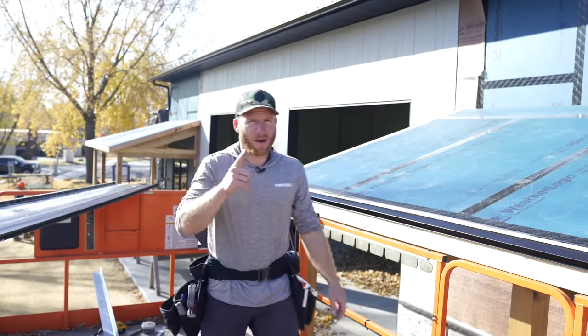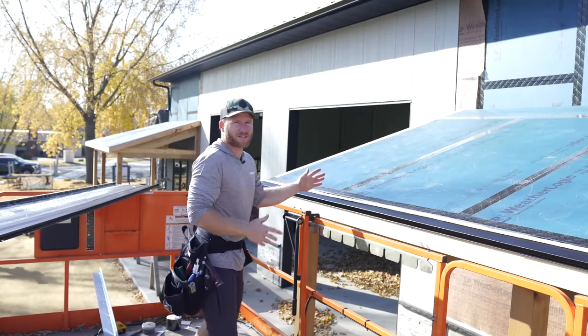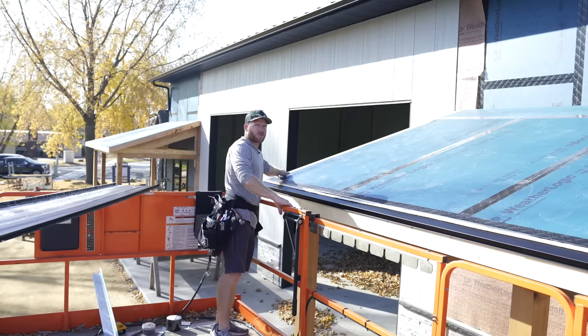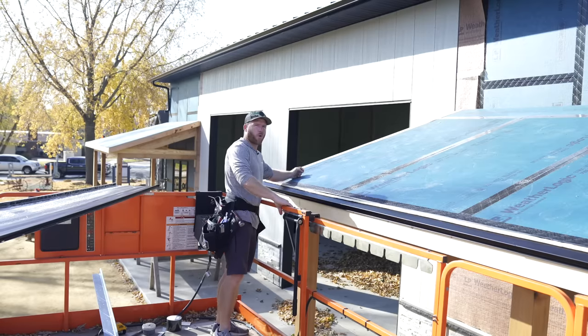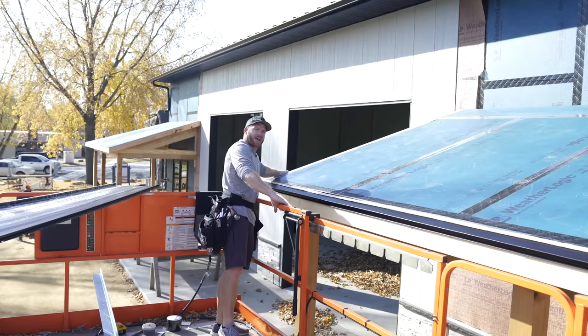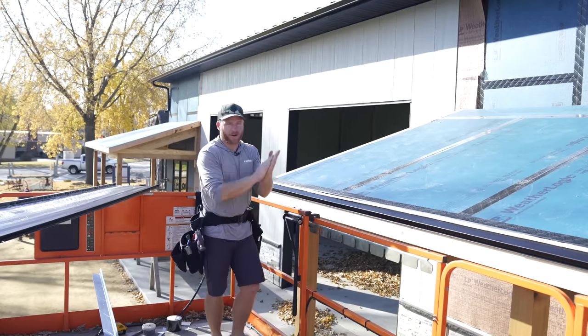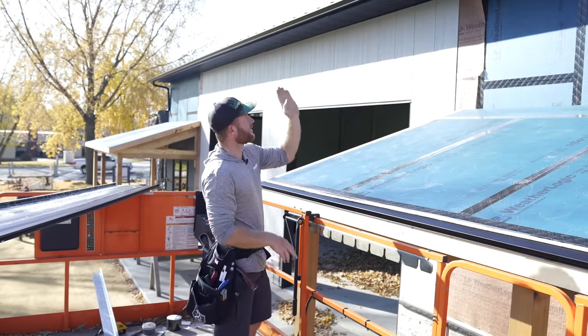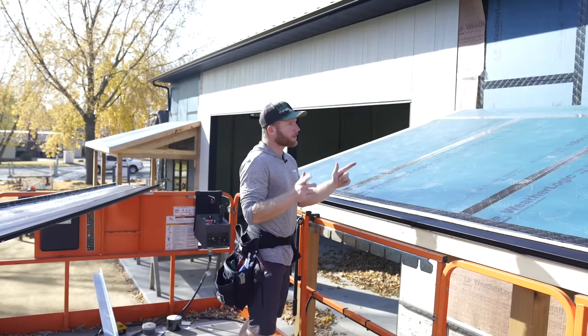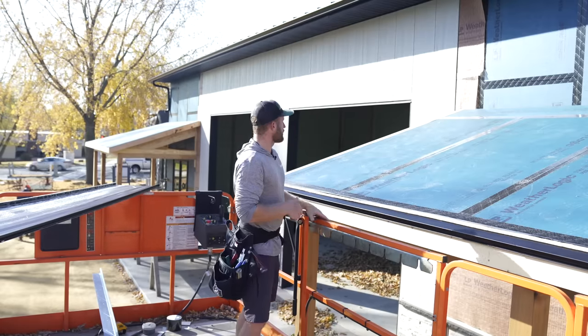That's right. As you probably remember, with that first piece of standing seam, we've got this rake cleat trim because this is what's going to lock on and hold the roof panel down. By having that rake trim, that's gonna lock onto this edge of this rake cleat and that first panel that we're gonna bend up. So what we're gonna do is line up our porch roof with our upper roof. We aren't gonna be able to line up with the vertical siding.